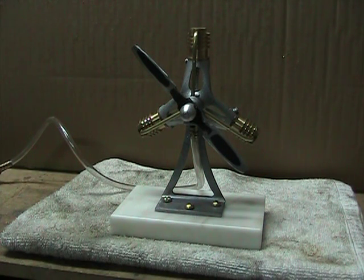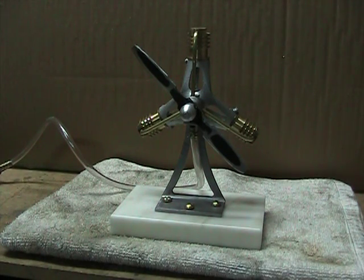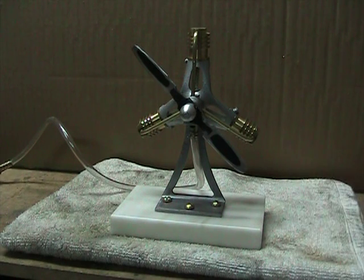This is a little 3-cylinder radial compressed air engine I built using castings for the main engine frame that I bought from a fellow in Germany. The rest of it is all bar stock. The cylinders are made from brass round, pistons and rods are made from aluminum. The inlet tubes here are made from brass tubing and the propeller is made from about one-tenth inch thick steel.